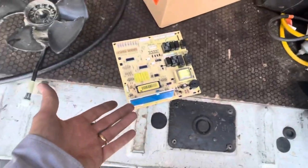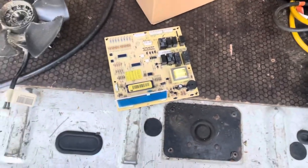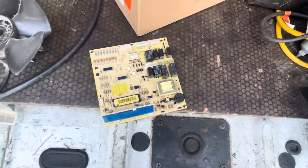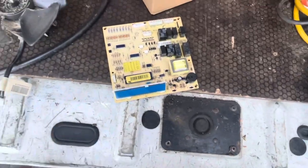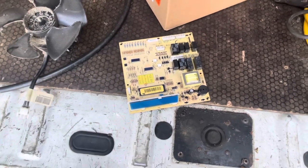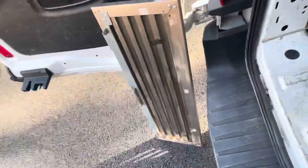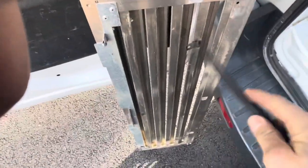I'm outside now from that house and I just want to explain: when I'm doing a computer board, I put the new computer board into place and let this dangle — power is off obviously — and I'm taking wires off of this and immediately putting them on the new CPU. This isn't a very advanced control board, it's only got about 10 wires, but some have a lot more. I like to keep it right in the area I'm working and go wire by wire. Sometimes I'll see technicians take off 10 wires at once and they don't know where anything goes and they've got to look at the wiring diagram. In the meantime, we'll nitrogen blow out this condenser grill and get it nice and clean.